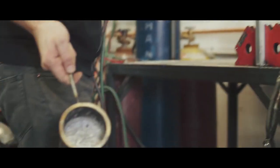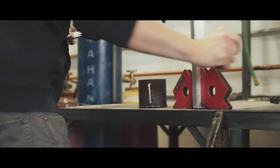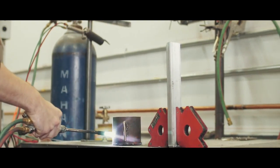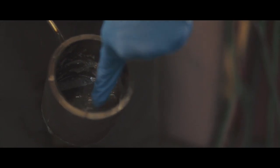So this is the low-melt bismuth alloy — you can see it's rock hard right now. I'm just going to add a little heat and get it up to about 160 Fahrenheit. This has also got cadmium in it, which is something that you want to avoid a lot of contact with. Just to demonstrate how low this stuff melts — you can see it's really not that hot. But don't do that with your bare hand because it's got cadmium and that's nasty.